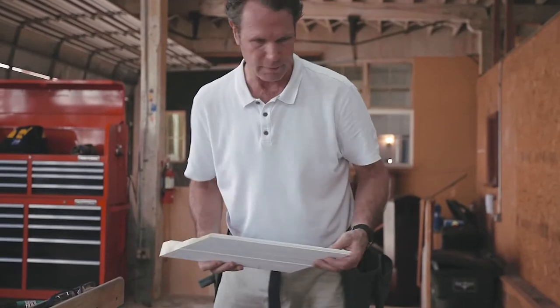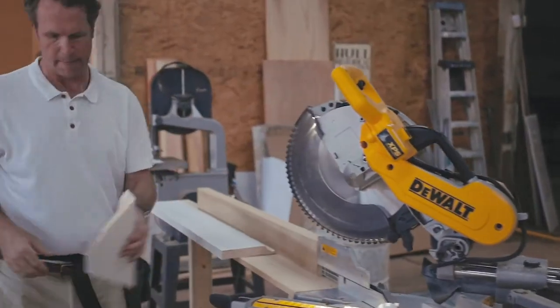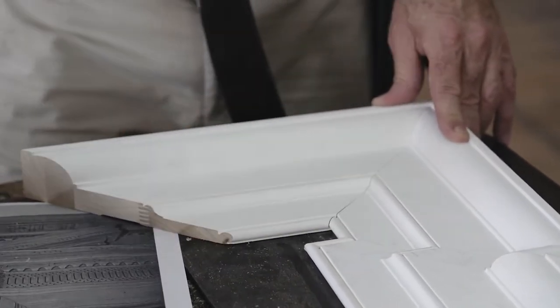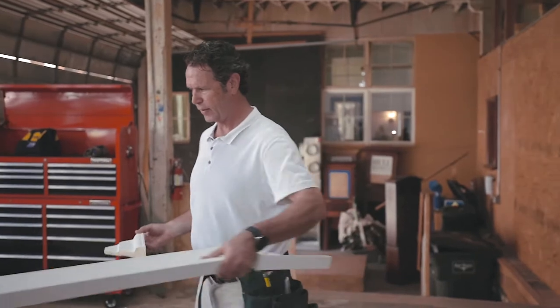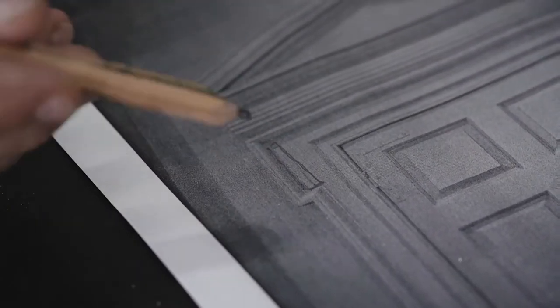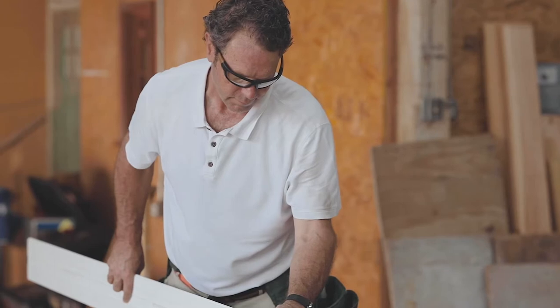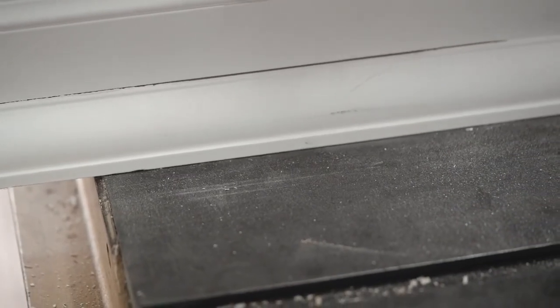Now our header comes across the top and we've got our little cross-headed corner — really pretty, a fun way to manage all these things around the opening. If you want that little decorative piece, remember your door comes up this way and you've got a nice cross-headed corner. The other way is inserting a block that kicks it out about one to one-and-a-half inches. It really doesn't take much to create this emphasis. This other type of cross-headed corner is made with a couple pieces of casing that I've already ripped down.